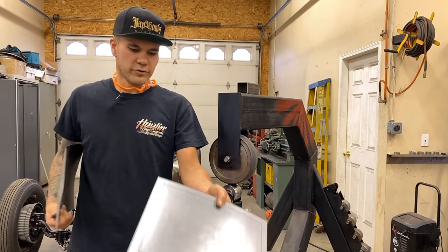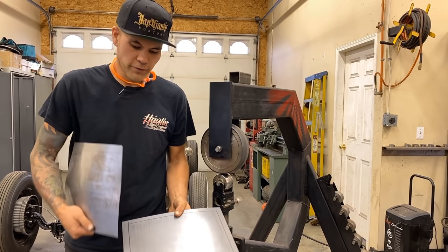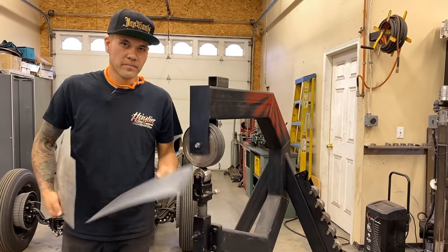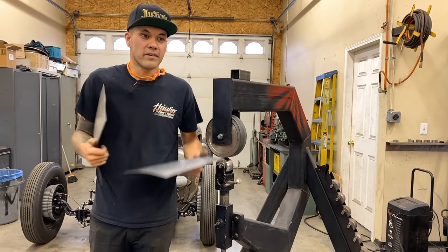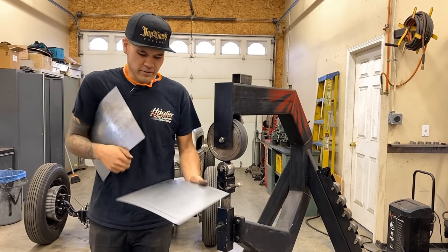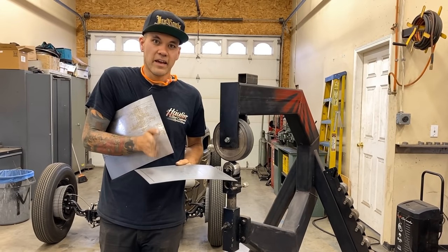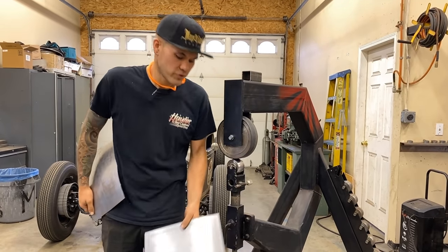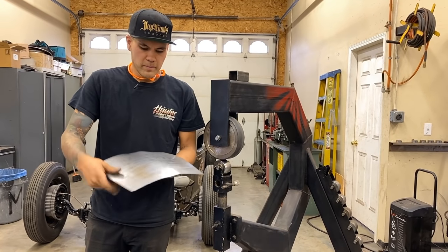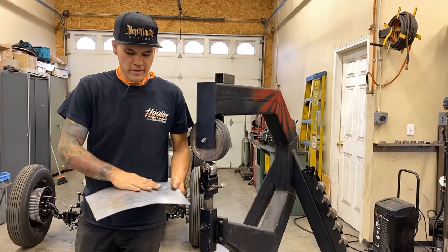We've got our stretched panel, just a couple of passes. We got some nice stretch in there. Don't forget about the frame. Take your time, experiment, just track yourself, get used to the motion of trying to run your wheel next to your last pass and just run it over all the way. You'll learn so much just by messing up sheet metal with a machine like this. Also, our planishing example where we used the sandbag and planished it all out.